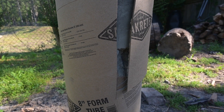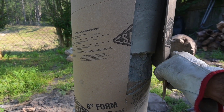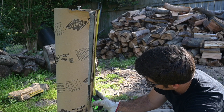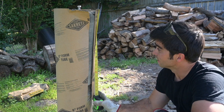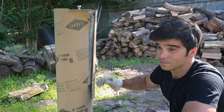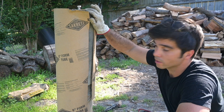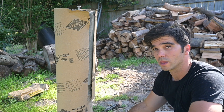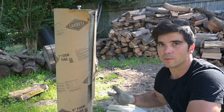It's not very far down — you can already see a bunch of dry concrete right there. So from the top of the form to there — it's 19 inches. Are you ever going to be pouring these concrete forms completely dry and then watering them? Only if you're super lazy. There are definitely other methods. I think if you're ever pouring a concrete slab that's 19 inches, hopefully you're smart enough to do the lower layers first, then do the upper layers and save yourself some time with the dry pour technique or some hybrid of it.